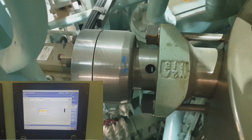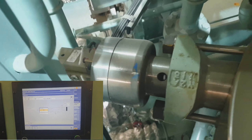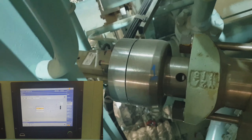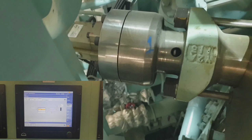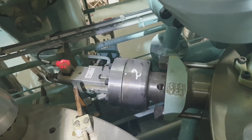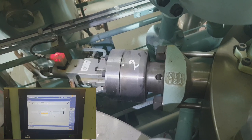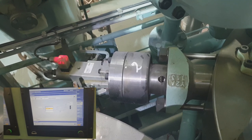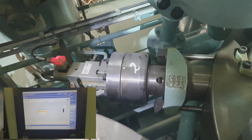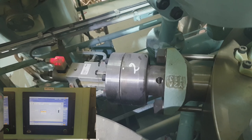As you can see from the engine side, we supply 7 bar compressed air since the main engine is in stop position. We start from unit number one. From the main operating panel, when it is switched on, it relays a signal to the solenoid valve and it pushes the spring to open the air starting valve.